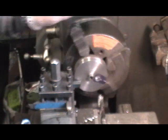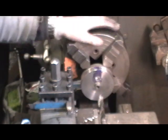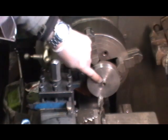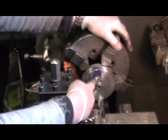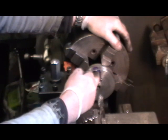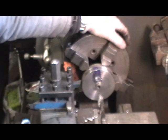I've drilled in about half an inch now, so I've got my one inch offset there. I can now put my wheels in on that centre line and then drill and ream all my wheels half inch diameter.